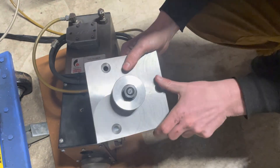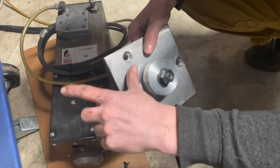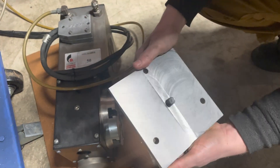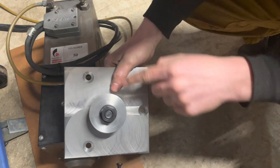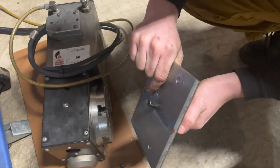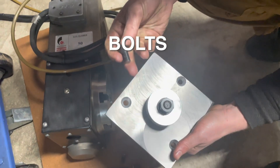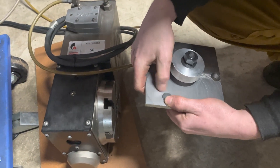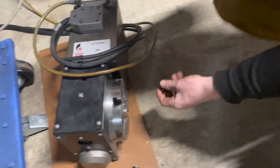We made a plate, faced it off with the fly cutter — surface finish feels good. The other side looks the same, nice and tight. Then we drilled a couple of holes, four of them, one in the middle, half-thirteen clearance for our nuts, and countersunk them so they sit below the surface.